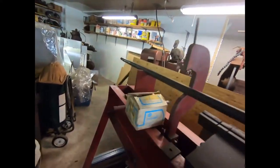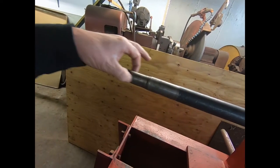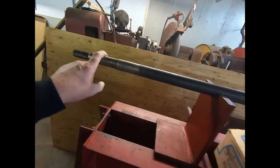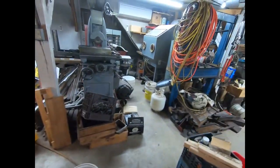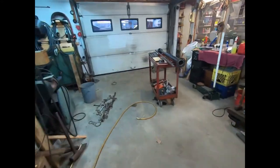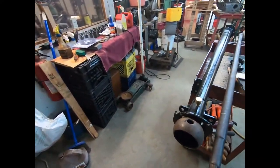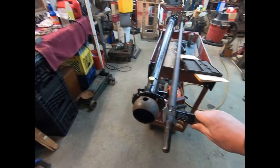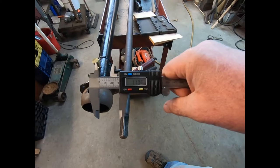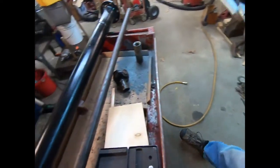This nice one down here measures an inch, 190 right here, and this is where it rides in a bushing. This one up here that's rusty only measures about 80 to 90 thousandths less — yeah, it's 106, so basically 85 thousandths or so less.